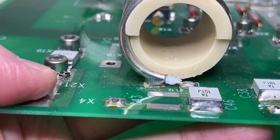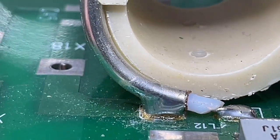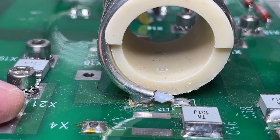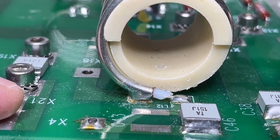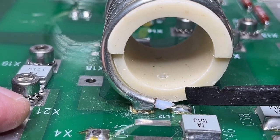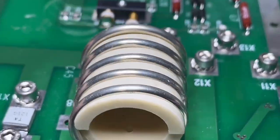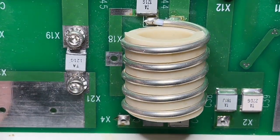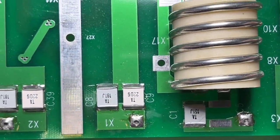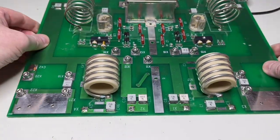That's not a wire — that's a coax. And this kind of coax is called rigid coax, because it's stiff like a single-strand thick wire, and it stays however you bend it. So here they made some kind of transformer or balun with that. This is how it looks on both sides. Another thing that was on this PCB was this capacitor — there are two of these variable capacitors, one on this side and one on the other side.